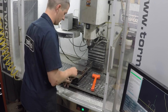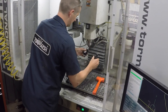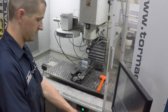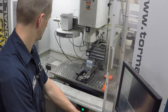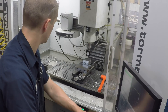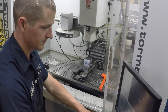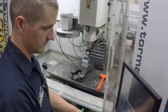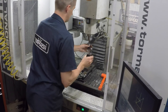Throw it in the Tormach and we'll use the Haimer. Hopefully you'll see just how quick it is — I love having the touch screen. We're just going to go down to the side and hit negative 1.5, because the part's three inches wide, and then negative 1.5 on the backside as well. Check it. Looks good. I always do my sanity check. Start off with tool 16 — quick sanity check — and here we go, let's rock and roll.